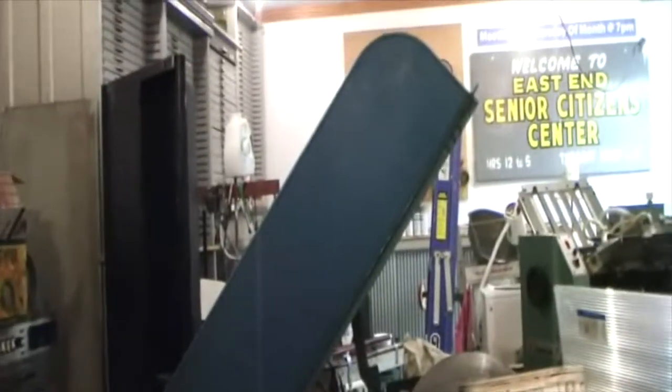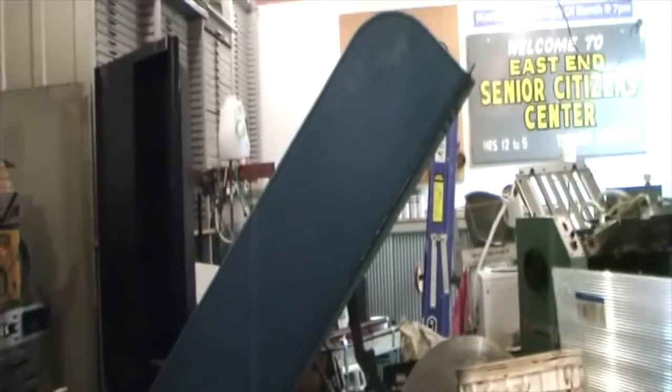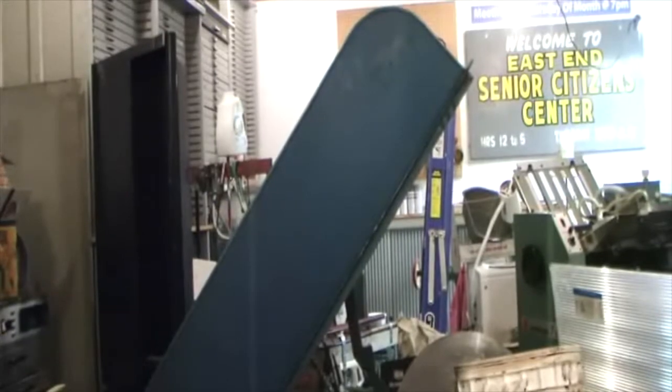So here's what we got. I got my 18-inch Frantom. And as you can see, when things aren't running, they tend to collect stuff. That's not how a saw should be. Heck, the blade's off, and I got buckets in there. So what we got to do is fix this one up. This has basically, I believe, the same problem that the HP had. The split nut is worn out, so it just rides on the shaft. We'll examine that a little bit closer later.